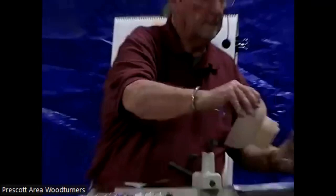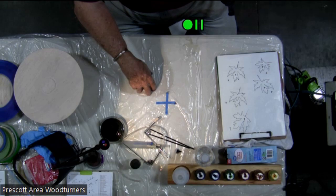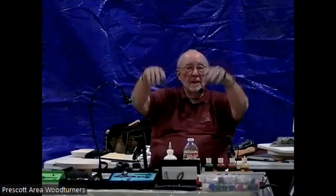While that's going around, I'm going to do a little brush cleaning here. When you were doing the spray and then you said you used a flame, what did that do with it? All he's doing is burning off the balance of the alcohol that's still there wet. And what kind of effect does it have? It's no effect. It just dries it. Oh, okay. I thought it did a pattern or something. No. It's just because he'll actually spray it first, and then he flashes it off, and it goes up and it's quick. And then he takes 320 sandpaper and goes over it one more time, or 400, one more time. And the grain is raised and it's kind of burned down and it's clean, but it's a clean piece of wood to go from.